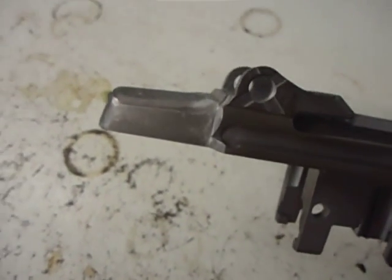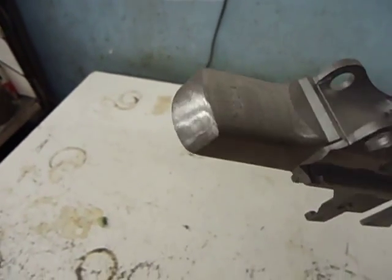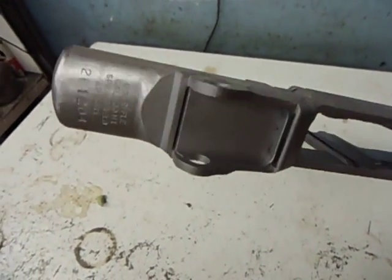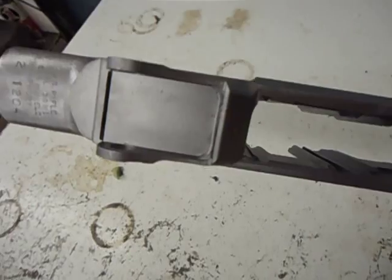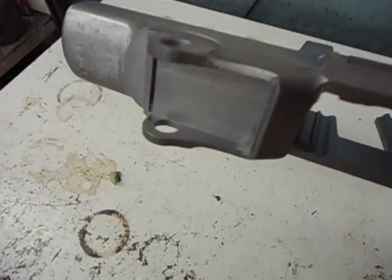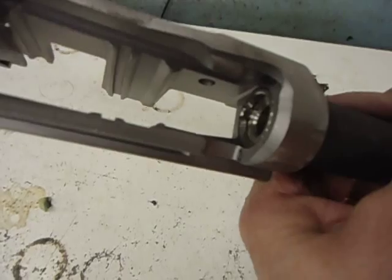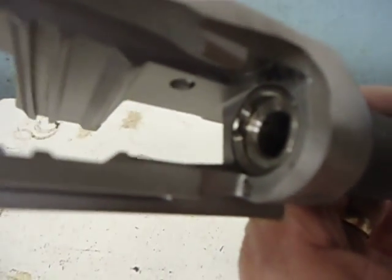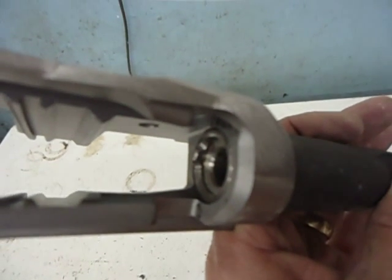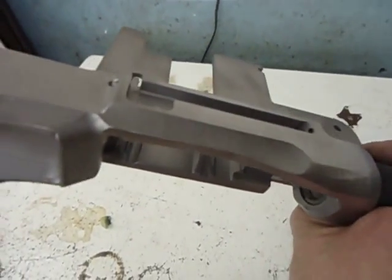But everything else is looking good, I'm happy. I did those radiuses around the back of the heel there, so all the pitting is gone there. A little bit of work with emery cloth now to get rid of the file marks. I've got that pitting that was on the edge of that sight base there. So everything's looking good now. I've got two little spots left — I've got a little bit of pitting going on right on the inside of that barrel ring. And then I've got that groove to take care of.